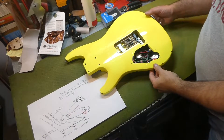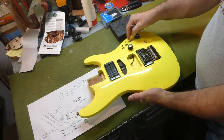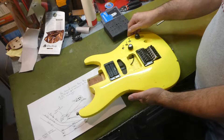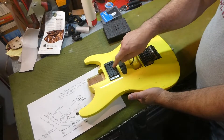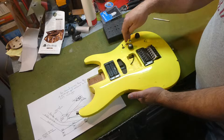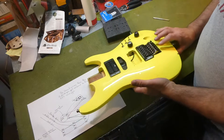Here's a guitar where I'm wiring three switches to each pickup. The on position will be down, so that's turning that one on, that'll turn the middle single coil on, and that's turning the original Ibanez pickup on. Of course, this way will be all off, and of course there's a volume and a tone.